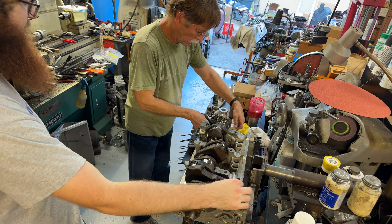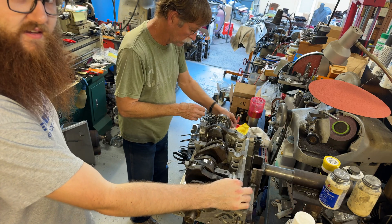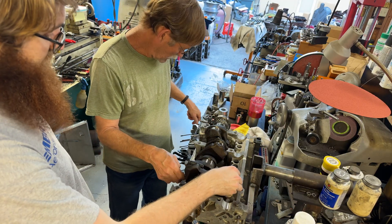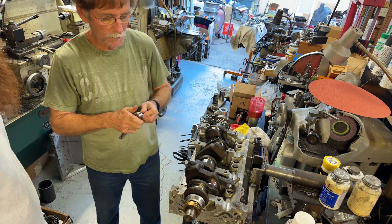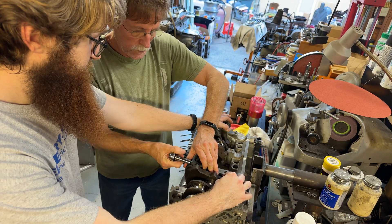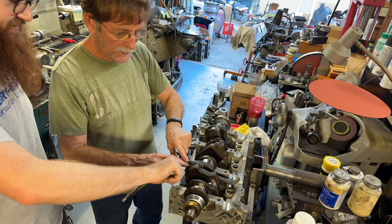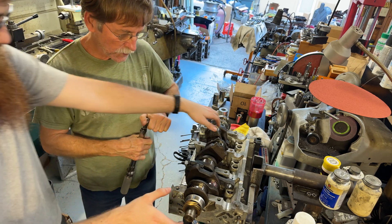I hope you guys like these shorter-form videos — just one-step kind of videos where you're seeing what we're doing. It's a lot easier for me to edit together, because otherwise it's several days' worth of stuff. These had the wrong nuts — these are ARP bolts but they were the ones from Clark's. Clark's come with the wrong nut — it's actually for a small-block Chevy, not for this. The socket doesn't fit correctly. It's nearly impossible to get a wrench on it when you're trying to assemble the engine in the crankcase, because the rod — this area here — I've got a 12-point and this socket is 3/8ths, which goes all the way down on there. If you had that big nut on there and tried to put a half-inch socket on it, it hits, so the socket only goes on probably less than half way. It's really idiotic and really hard to get a wrench in there and get that thing tight.